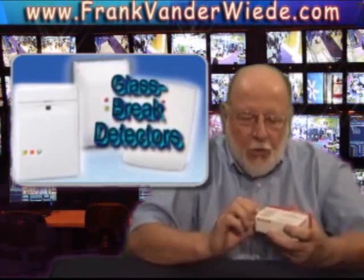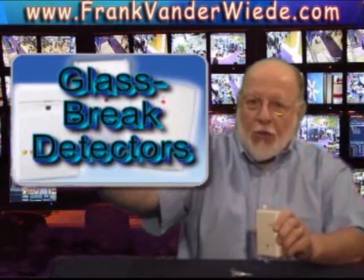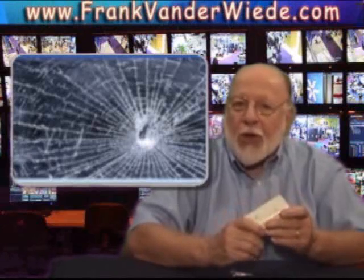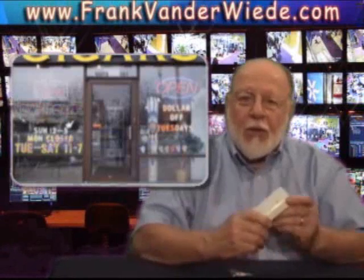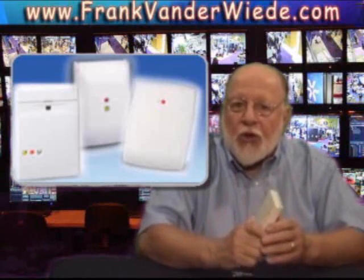While we're talking about detectors, even though this kit doesn't come with a glass break detector, we should show you what it looks like and basically tell you a little bit of how it works. They also would mount on a wall, and can hear usually at a 25-foot radius around the room. What it's listening for is the particular frequency — the pitch that breaking glass would make. When it hears that pitch, it activates the alarm. We use these sensors more often in stores, a place where you have a big plate glass storefront. Occasionally they're used residentially — if you have a room with a lot of glass in it, it may be a good idea to use this sensor. These can be mounted on a wall opposite glass, on a ceiling along where the glass is, or on the same wall between two windows. It's very flexible. Basically, where you can reach it with the wire is the key.